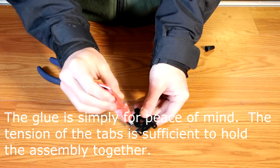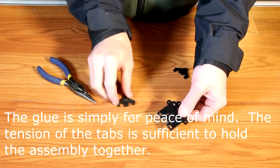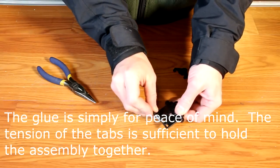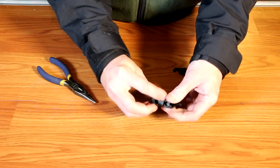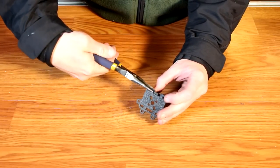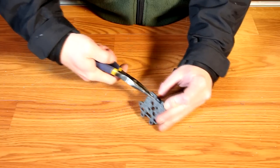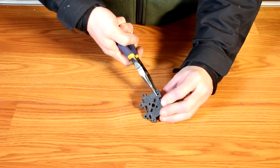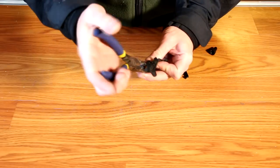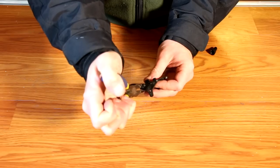Once heated, add a little bit of glue to the side with the open gap on either side of the gap. Then take the larger swivel piece with the three holes in it and the bottom tab and insert it into one end, rough side out. Get it squared up, then taking your needle nose pliers, snap one side into place. Once snapped in, go ahead and repeat the process for the other side. Once snapped in, the plate should be fairly secure.